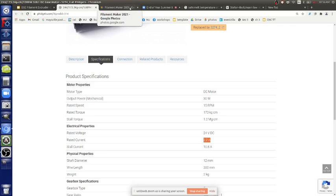So we could try PWM control, which is, you know how you have the 0 to 255 values to turn on D8, D9, D10? Yes, you can do that, and you can do a partial turn on. I forget if full is 0 or 255, but whatever it is, you use a partial value. If you want the motor to run at half speed, you would set that value to, say, 128, and you're running at half speed. But what it's actually doing is rapidly turning it on and off at 50% duty cycle. So we have that capacity as well.